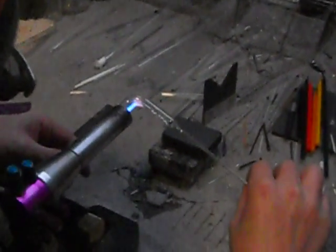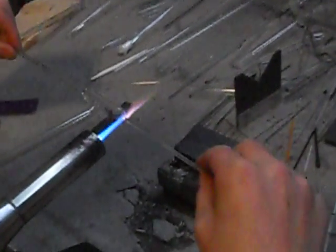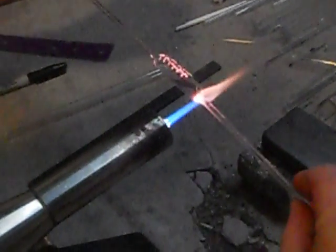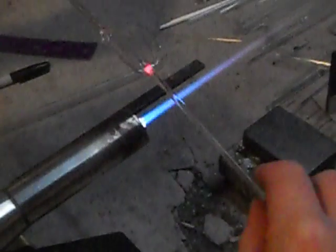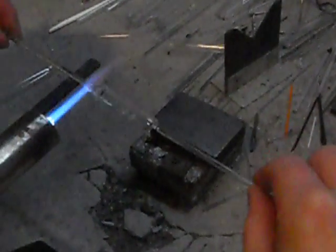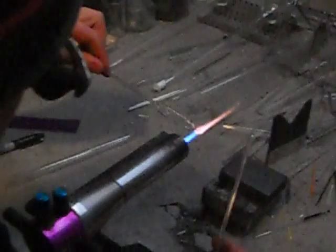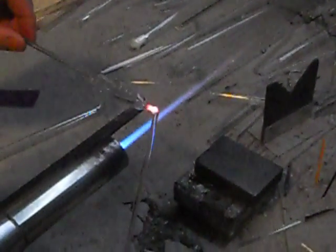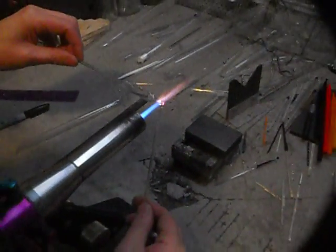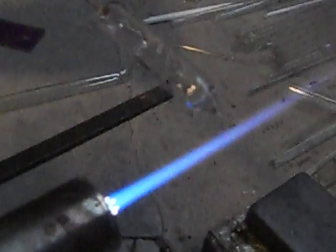Attach it on the end. Flame cut. Attach a piece of four mil. Take the first piece of four mil off. Leave a nice point on there. You want this little end to be thickened up because you're going to stick it through to the other side and you're going to bridge it — you'll see what I mean.